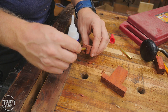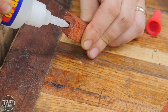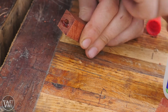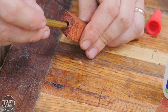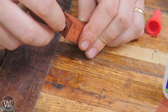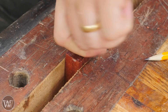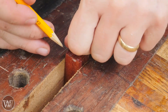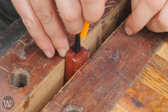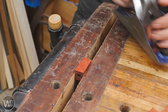I'm going to be using 2P10 gel CA — cyanoacrylate. It just glops in there and the gel helps to fill any gap. Because the hole isn't quite the size I'd want it to be, I'd like it a little bit tighter, but this will work. You can see how it actually slides in there a little bit looser than I'd like, but it works rather well still. Next I need to actually see the size that it needs to be — you can see this is the one where I was a little off center, but well within what I need to be.